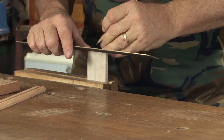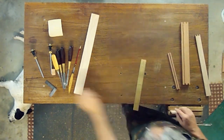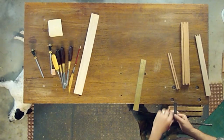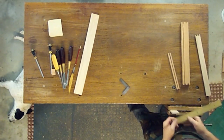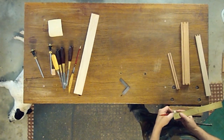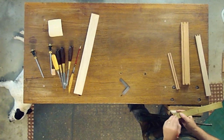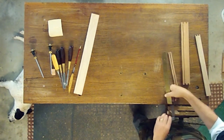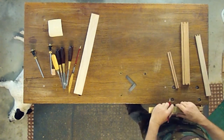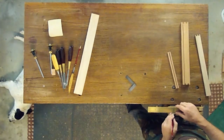But because I haven't got as much room, I'll only come in about 2mm from the ends. And again, I want 2 dovetails. So I mark those lines across. I find a number that I can divide by 2, which is - if I turn the ruler - that'll give me 30. So half of 30 is 15. That's the centre of my piece. If you wanted 3 dovetails, you'd divide that by 3, so that's 10, 20, 30. That's how you can divide very easily. So that's the centre piece. Put a pencil on it, move the square up to it, mark it. And then we come in about 2mm on those lines we've just drawn.